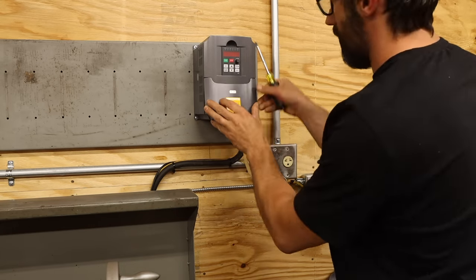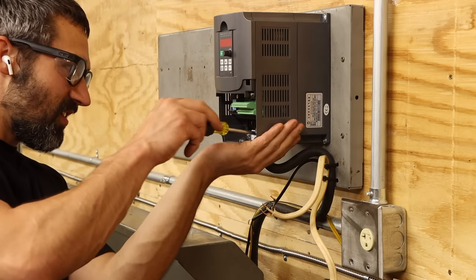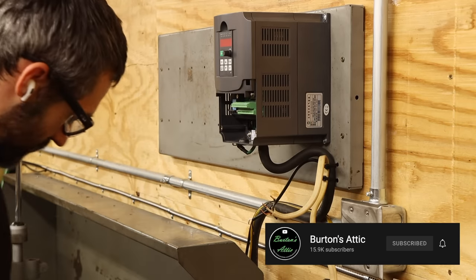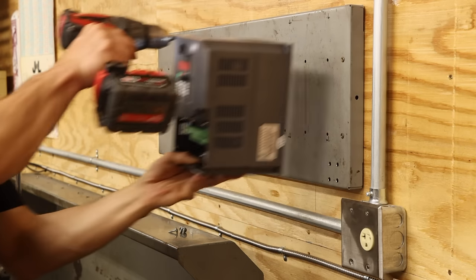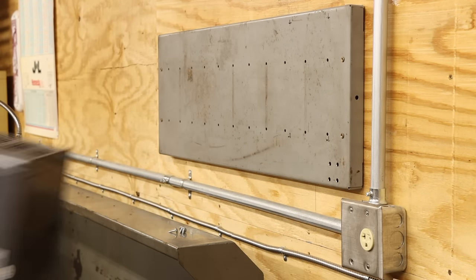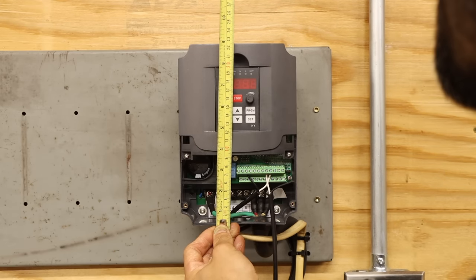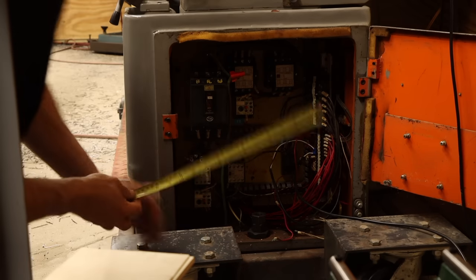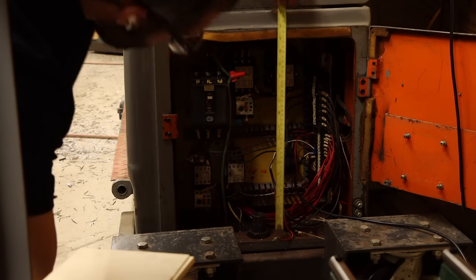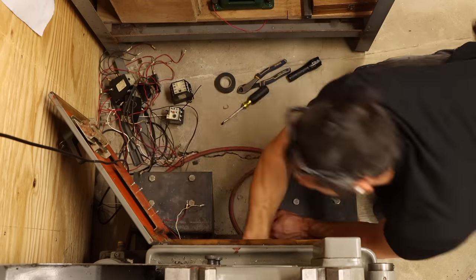I think I'll call it a night and start fresh with some machining tomorrow. Just kidding — it's never that simple. After some more consideration and talking to fellow machinist YouTuber Burton Zadig, I discovered a very large and dangerous error in my setup. By electrical code, you can't have any form of break in the circuit between a VFD and a motor. And right now I have a disconnect, a motor contactor, and a motor protector. By bypassing all the control circuitry and just using the switches in the lathe to trigger the VFD, that means I won't be needing all these old control components. So out they come.